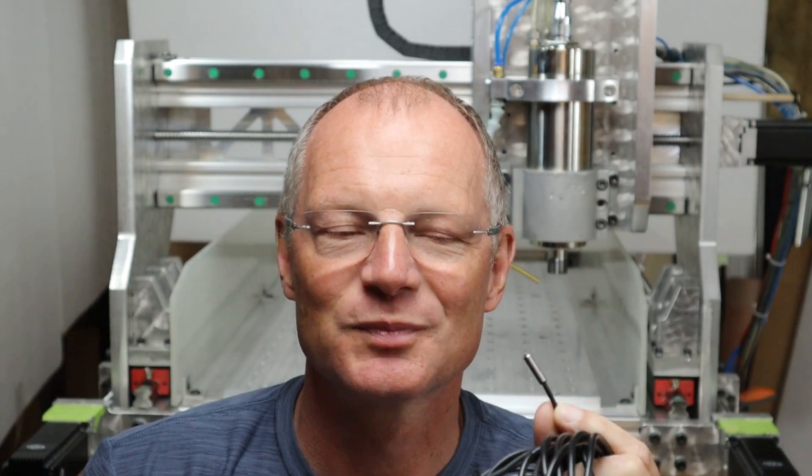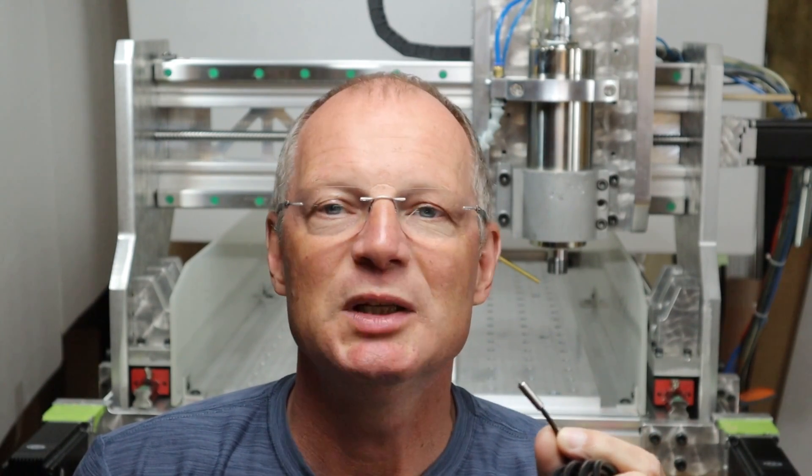The next one is a little piece of awesomeness. This right here is a one-micron limit switch — or in our case, home switch. It's a mechanical switch, so also two wires, and the repeatability is better than one micrometer. This one is made by Metrol, a company out of Japan.